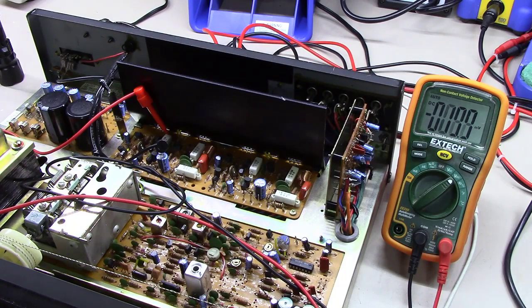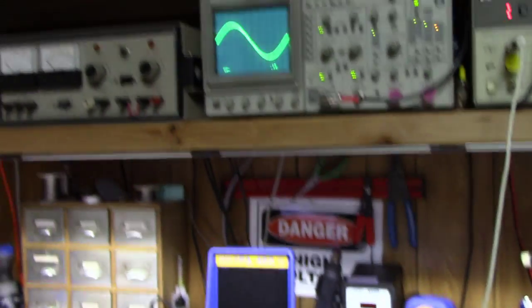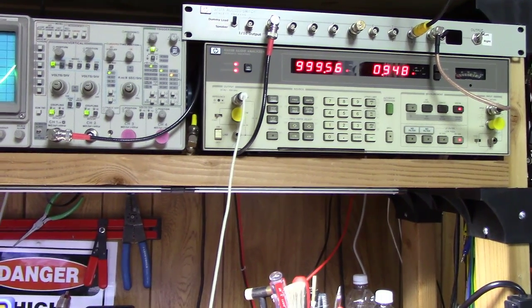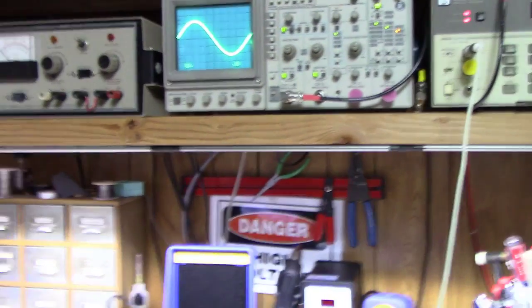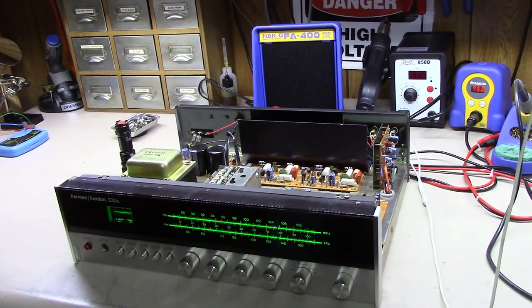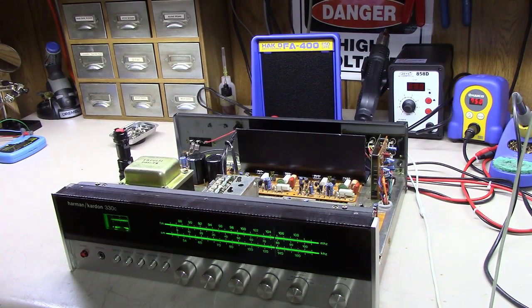The other side is right at 10.0 millivolts — very happy with how that turned out. Now I'm going back through the same set of tests I did yesterday using the function generator and the HP 8903. So far I'm happy with how this thing has spec'd out. I'm pretty sure this will solve the noise issues and get this thing back to a happy customer.